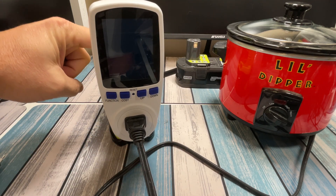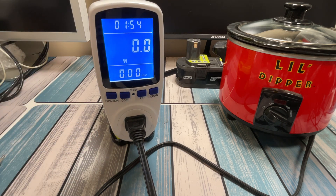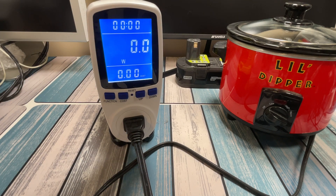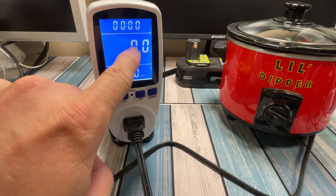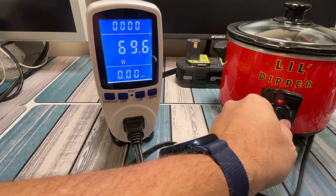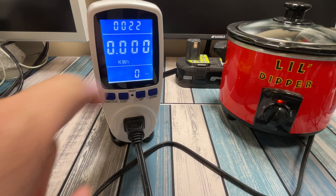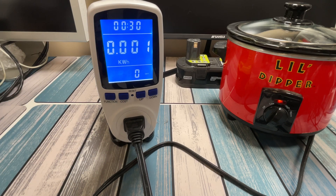Let's go ahead and turn on the power inverter. We've got power going here. Let me reset from my last test and clear this out. These power meters are pretty cheap on Amazon and for tests like this they are very much worthwhile. This is going to tell me how many watts and start that timer. We're seeing 69 watts on low, 91 watts — and there's high, actually drawing a little bit more than usual — 122 watts on high. The timer is clicking up, and if I switch to the kilowatt hours function, that's what's going to start counting up. I'm going to switch over to a timelapse camera and record this whole thing. Once the battery dies out, we'll see where it stopped.